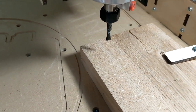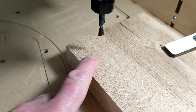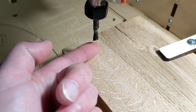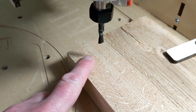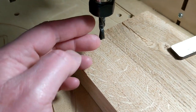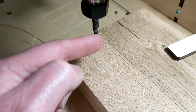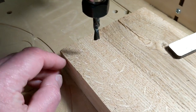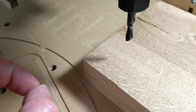The technique I'm going to show you will demonstrate how to set the Z zero point where the tip of this tool is zeroed out on the top surface of this board. Then I'm going to show you how to find the exact corner location where the center of the shaft will be zeroed over, so your absolute start point will be the very corner — and it'll be very accurate.